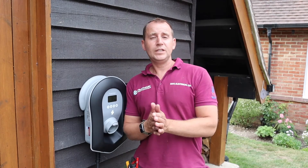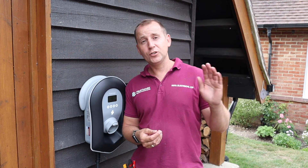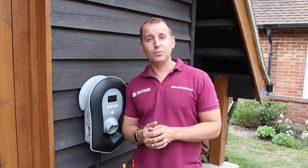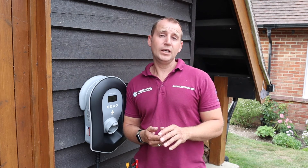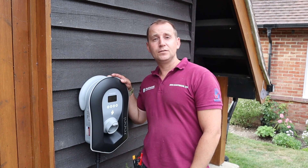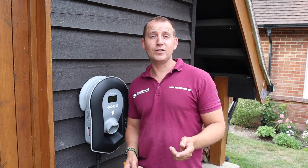Hopefully now you have seen how we overcome some problems with EV charging installs. The first problem was we could not use the existing consumer unit, so we installed an IP-rated consumer unit on the outside next to the meter box — this is absolutely fine to do. We've then disguised the cable throughout the whole installation and we have ended up here with the Zappi mounted on the garage. Thanks for watching — hit the thumbs up button, like and subscribe to my channel, and follow me on Facebook and Instagram.